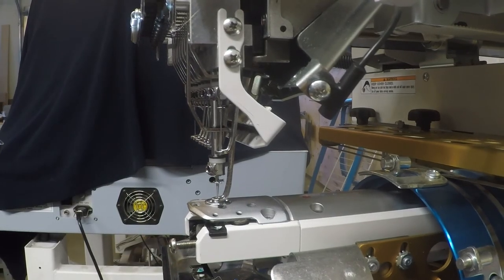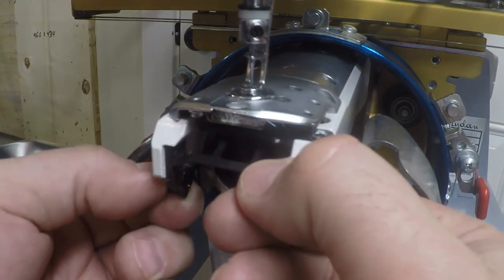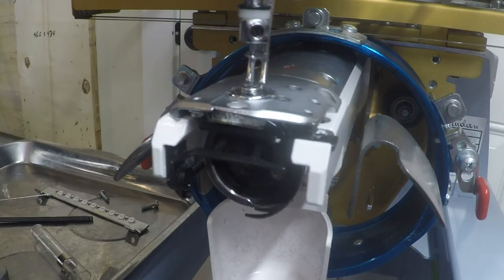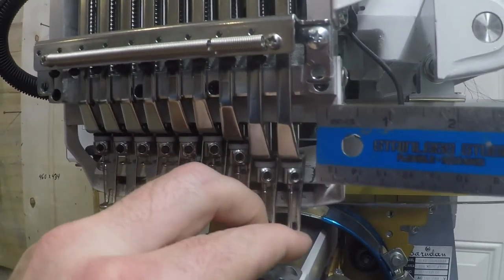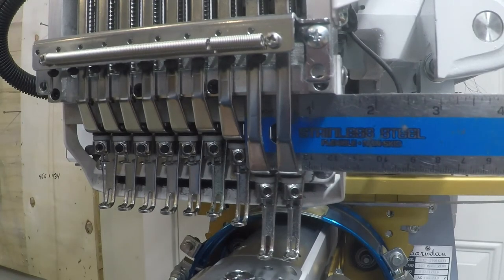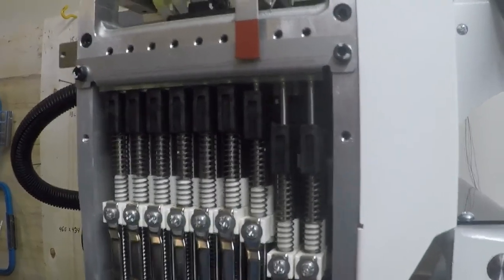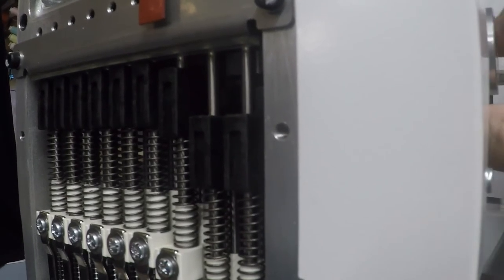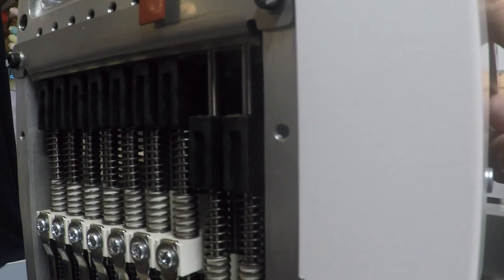The next thing is jump timing — that's very important. Before moving on, make sure the e-fork's little shaft goes in the hole down here properly and is latched. For jump timing, move to the third-to-last needle — number seven on a nine-needle machine, or number thirteen on a fifteen-needle machine. Take a ruler, pull the last two feet down and stick the ruler in behind the presser feet to jam them down. Move the degree wheel to 185 degrees.